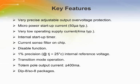Although the IC is optimized for power factor correction pre-regulators in electronic lamp ballasts, AC to DC adapters, and low power 150-watt SMPS, its excellent performance and extremely low external part count make it suitable in unconventional topologies and applications. The device features a true micropower startup current, 50 microamps typical, and low quiescent current, a very precise internal reference of 1% at a thermal junction temperature of 25 degrees C, and an on-chip RC filter on the current sense pin and a multiplier with extended dynamics.